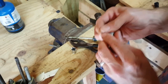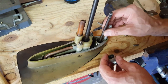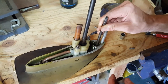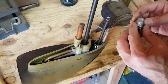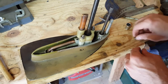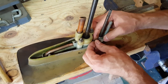Now back over to the lower unit. This is the shift rod. When we disassembled it earlier, it's important to make sure that you have noted the direction of the flat on the splines. The flat keeps it oriented so that forward is forward and reverse is reverse. Put the shift rod in place and slide the bushing and seal over it, then seat it into its recessed hole. Then the retaining screw is reinstalled.